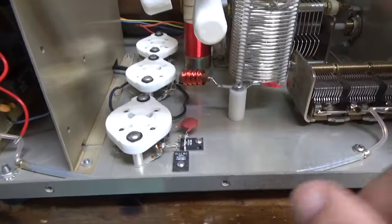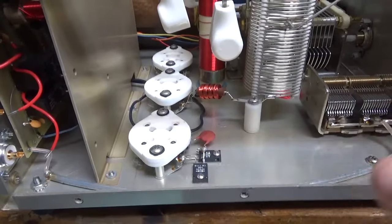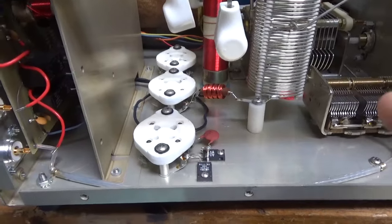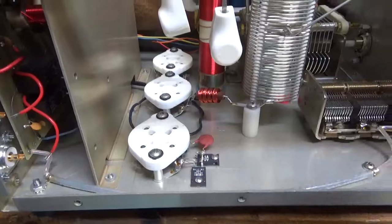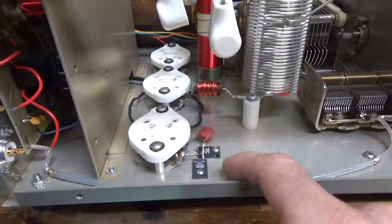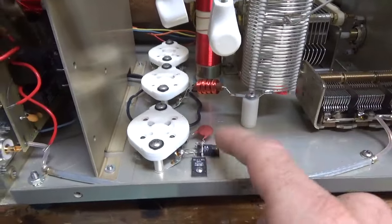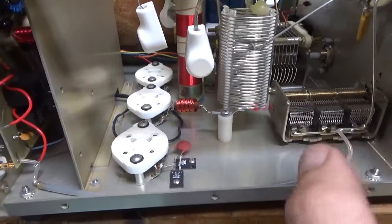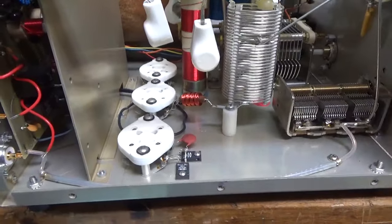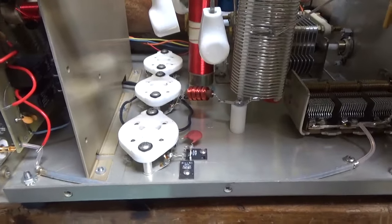They also make it so the transceiver has to put out more power to drive the amplifier to full output, because they pad the input a little bit. Well, the resistor ends up dissipating some of that drive power into heat. So I'm going to pull them out and I'll see if I can retweak the input, each input circuit, so I get them down flat again.